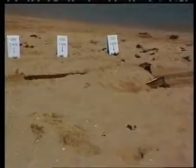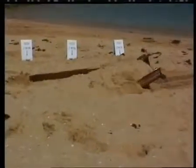The 300 kilogram DMS 300 begins in the same manner as did the Danforth and Poole anchors. It drags with gradual build-up in holding power that reached 390 kilos after 1 metre. By the 2 metre mark, holding power has increased to 2,020 kilograms.